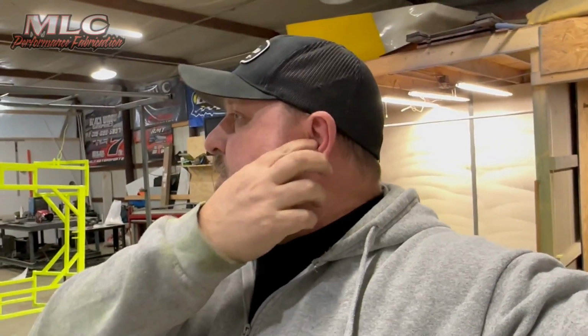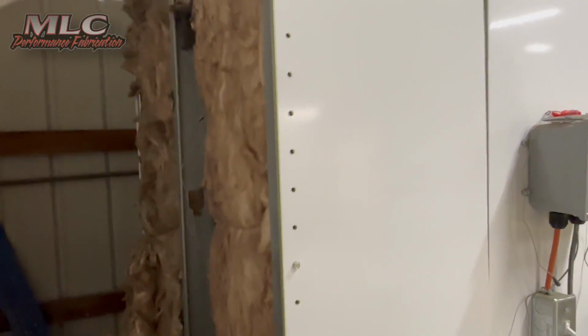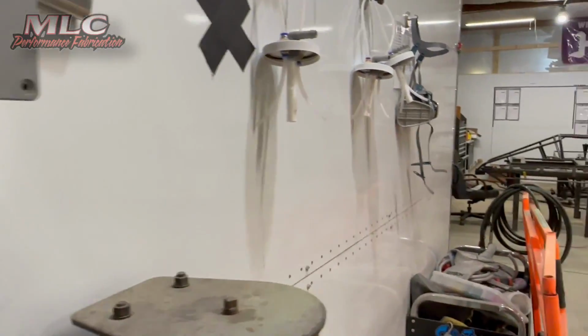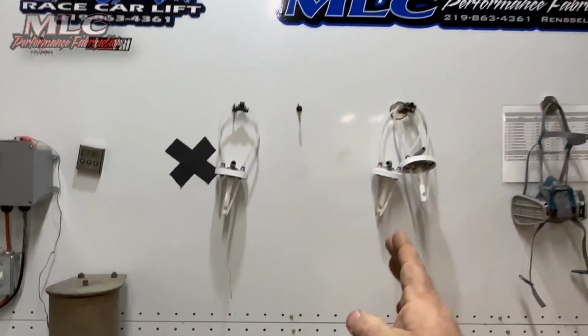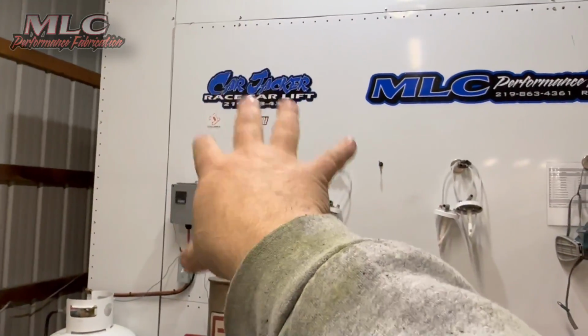Like I said, recovery time is about 1.5 minutes. So once it gets down to 403 degrees, it kicks back on, and then with that initial blast from the heater, it drops to like 392, 393. And then from that point, about 1.5 minutes to get back to 410. I didn't use the rock wool, which at some point I think I'll go back and re-insulate this thing. But it's this unfaced I got from Menards. Like the back stuff, and it's not even that great. It's like an R13, and this back still needs finished. But then there's R13, because the oven itself, from like, well, 4 foot in, so from like right there back, that's like all R13 insulation.